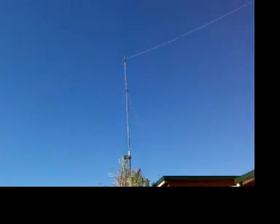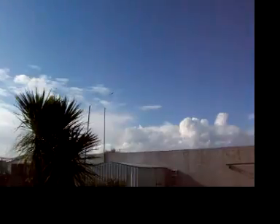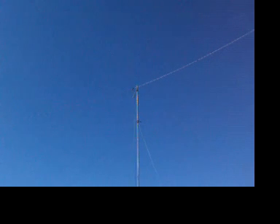Let's have a look — there's the tower, there's the pole going up. It's up about 28 to 30 feet from the ground. Just got the dipole going down that way, so a pole down the back. There's two poles here because we had to bend the leg in to get the 80m leg in. It goes down and across, as you can see. Then from the shorter pole there, closest to us, is the 40m dipole going back up to the peak of the mast. Then the other leg of the 40m dipole comes down here.